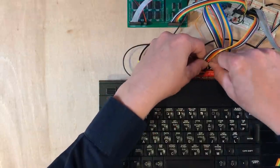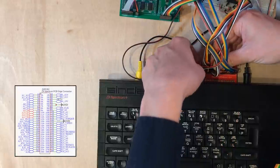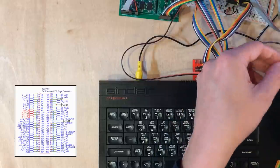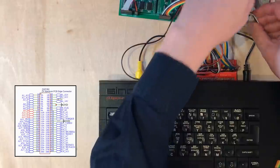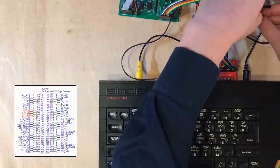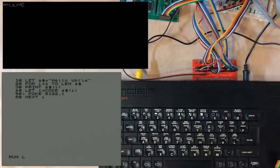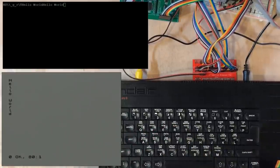I think my cleverness with the pre-made cables cost me a simple win there. All right, let's try this wire. So this is the middle four bits I'm supposed to be plugging this into. So this is replacing the black through orange wires. First one is red. That's bit six. That's supposed to be the high bit where the orange was. Then bit five, then we jump to three, and then four. Bingo, outstanding.